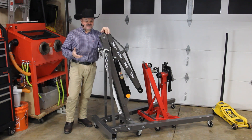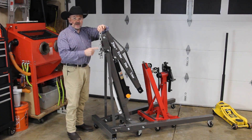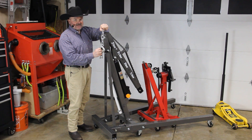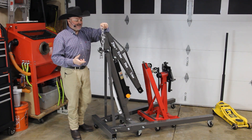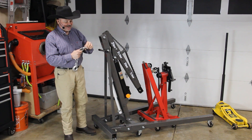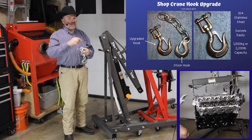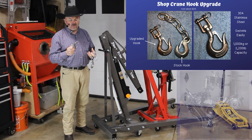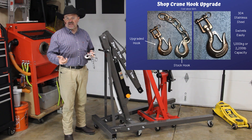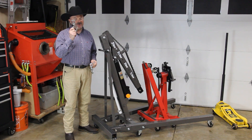My last improvement is my absolute favorite and was a real game changer — it relates to the hook and chain. The stock hook is heavy duty but doesn't swivel, so you get maybe 90 degrees of rotation before the chain binds and whatever you're lifting wants to twist back. I went on Amazon and picked up a stainless swivel hook with full 360-degree rotation. The weight limit is 1,000 kilograms or 2,200 pounds, which was more than sufficient for the V8 motors I was working with. I highly recommend this upgrade — I'll put a link in the description. It's a game changer.